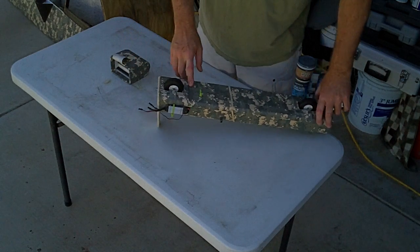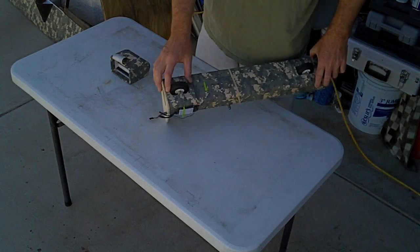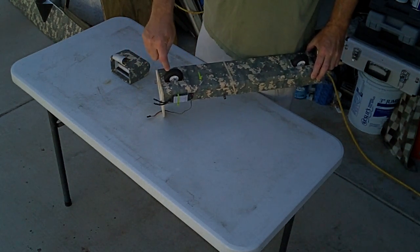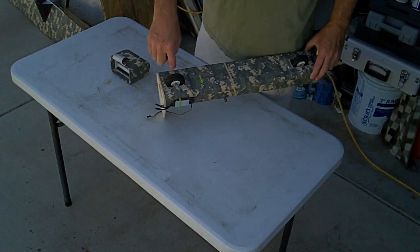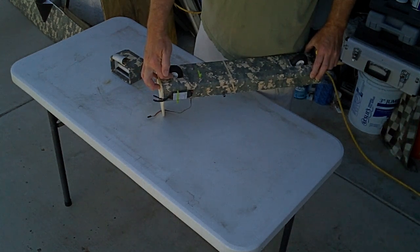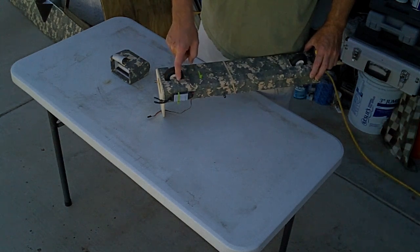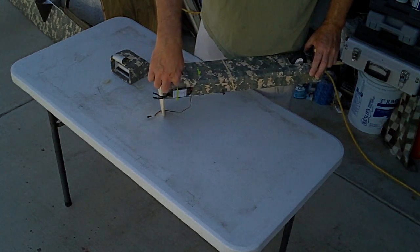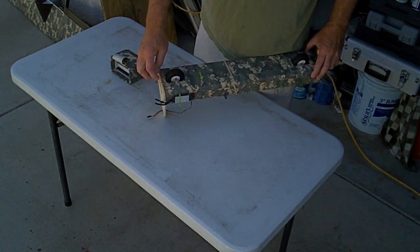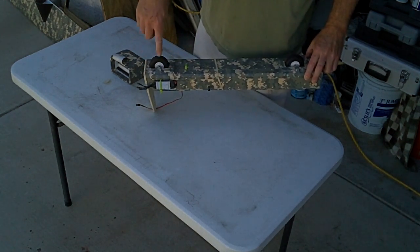So this is a simple plywood base that's hot glued. It's got a cutout for the wheel to fit in here, which is a bit oversized. It could be a smaller hole, but ventilation is nice too. I use a metal axle that runs across. I hot glued it in place with the wheel in it, and then I used some wood material here, like 3/16 by 3/16 square, to brace on either side of the axle. Then I used them as stops for centering the wheel. I came up just short of the wheel on both sides, and it doesn't cause too much friction there, and it keeps the wheel in the center.